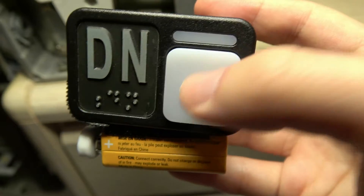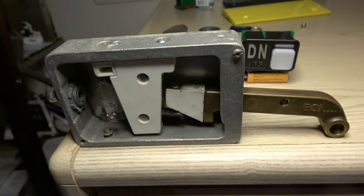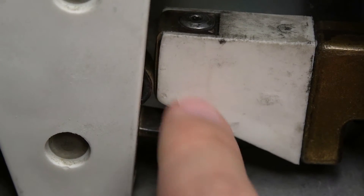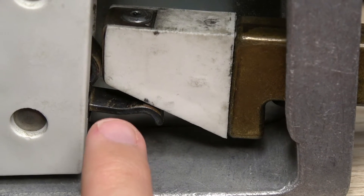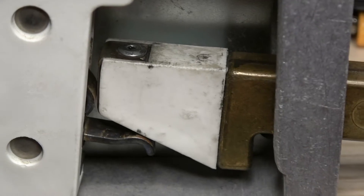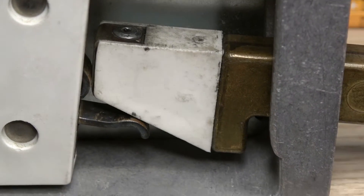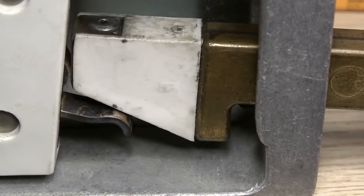With this type of fixture — these two metal pins that you see right there are the switches, which keep the hoistway door shut. So when the elevator car is not present, the door will not open. It'll do this if you try to pull it open — it only does this. That means it is locked with this latch right there.